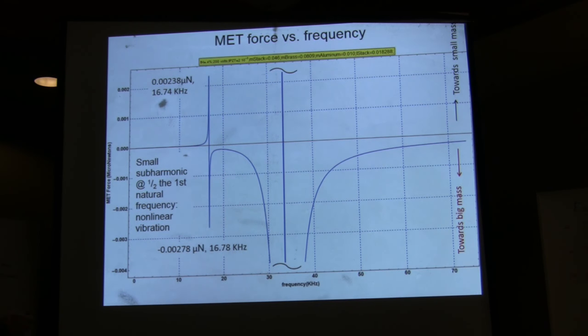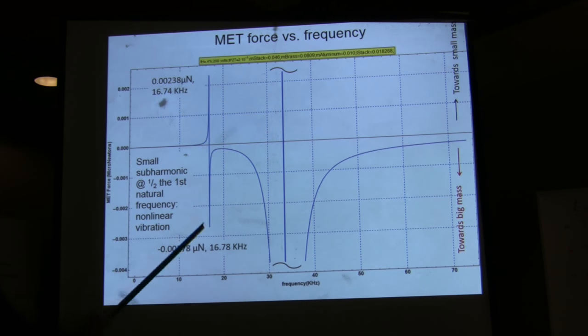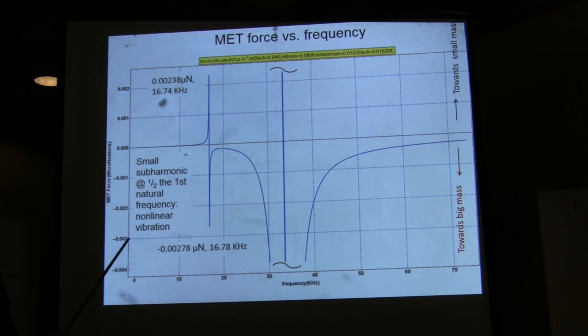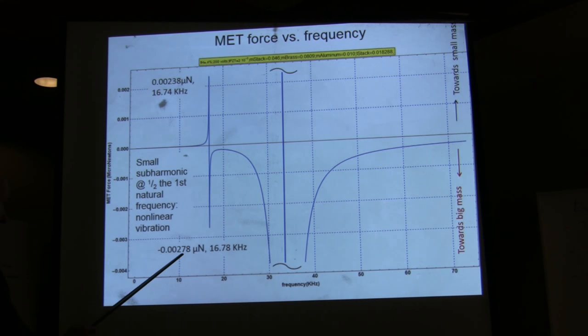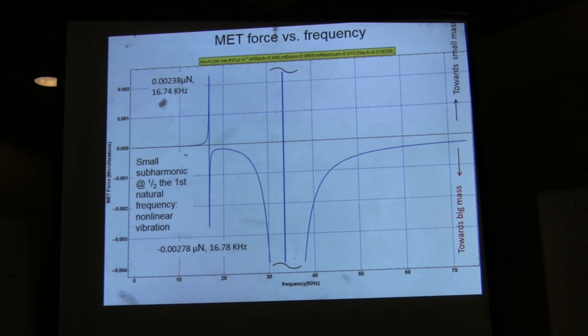if you do a calculation for a typical stack that Jim has been running, then, here just for curiosity's sake, I wanted to look at the electrostatic resonance, which occurs at half the natural frequency, which is the one that he's interested in because it's much larger. Then you see it's there, but it is at, these are micronewtons. So this is at thousandths of a micronewton. So it's only like 2.8 nanonewtons. And it's actually slightly asymmetric, but that resonance is there, but it's extremely small.